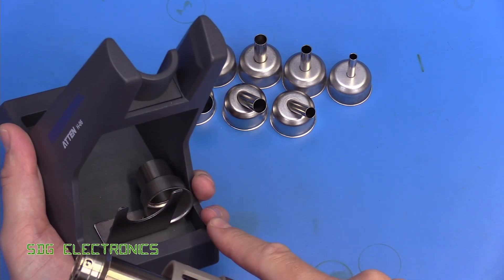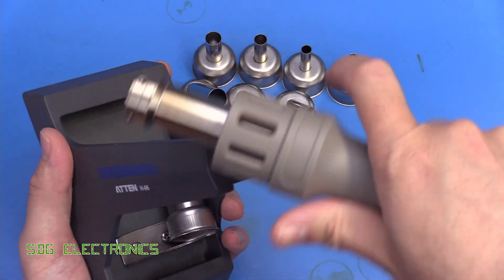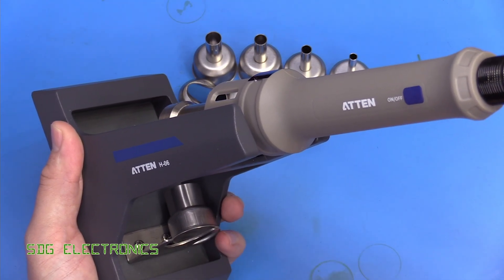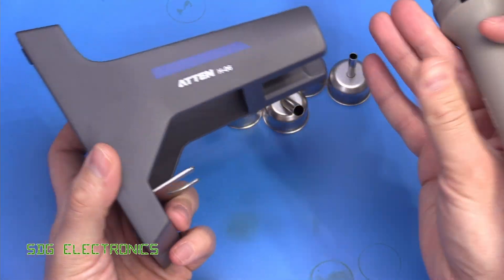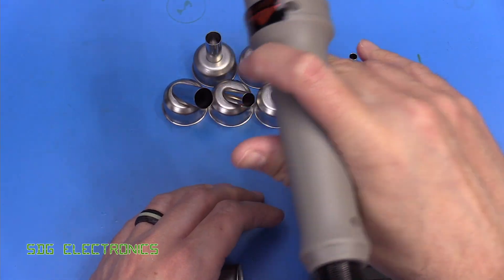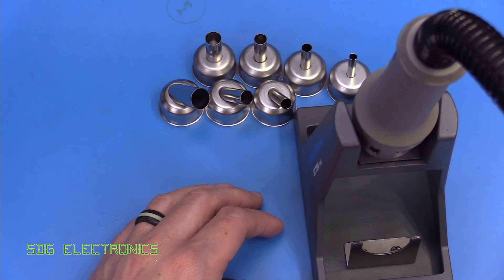The cradle is pretty much the same as every other cradle out there. We've got a nozzle removal tool — you just put it in and it drops to the bottom where it can be left to cool down. There is a magnet in here, so when you place the handpiece in the cradle it knows it's in there and allows it to shut down. It's fairly heavyweight, all made of metal with extra weight at the bottom, and it sits quite happily without any risk of falling over.